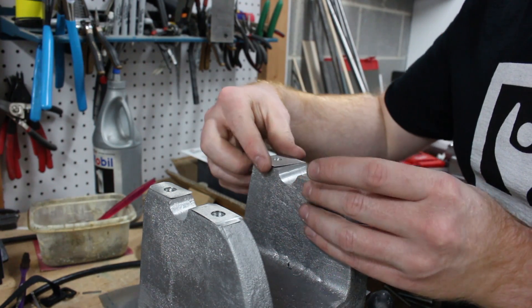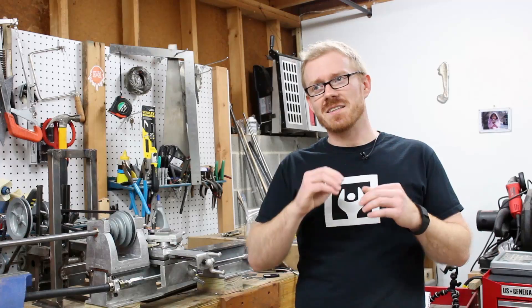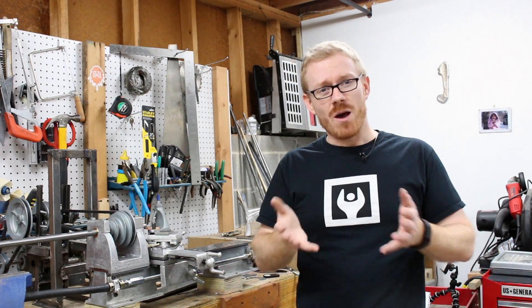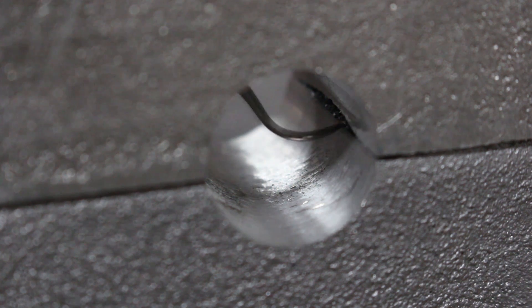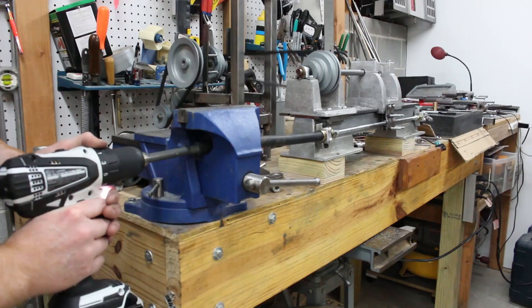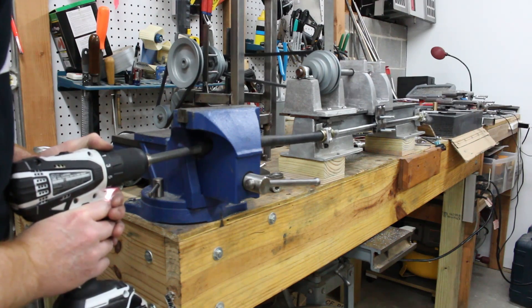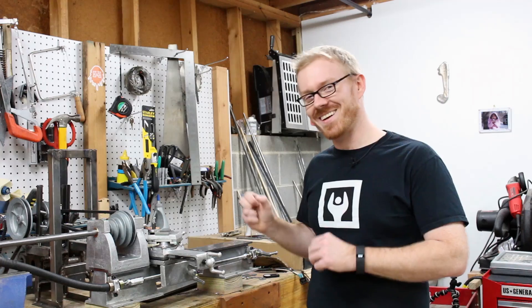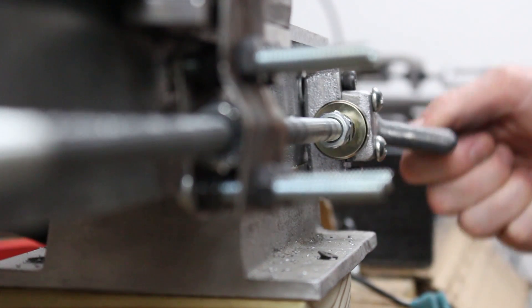You may recall from the previous video, the larger bearing cap had a little bit of shrinkage from the casting and I didn't get rid of that because I knew there was going to be a hole through that part. However, it turns out that the shrink void extends far enough into the sides of the bearing cap that I think it added to the chatter during the boring operation and also provided a little recess that just collected the swarf from the cutter. During the boring operation I tried to speed it up by hooking up a hose to the end of the lead screw and using my drill to quickly advance it, but that didn't work out well because I was frightened the whole time that I would run the headstock into something. So after playing around with that a little bit, I ended up just running it by hand for the rest of the operation.